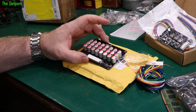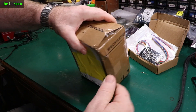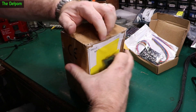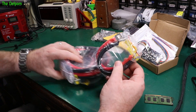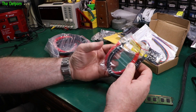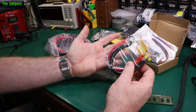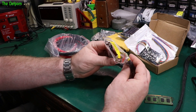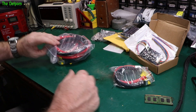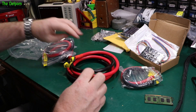Last thing — maybe. I might add more to the video later if I get more mail before it comes out. I have some pre-made battery cables. My existing batteries have got some links which I made up, but to be honest my crimping wasn't the best on those — I didn't have the right crimp tool for the connector size at the time. Now I've got the right cable and crimp tools, but I thought I'd get some pre-made ones because there've been many situations where I wished I could just snap them on and not worry about it. I've got some different lengths pre-made.